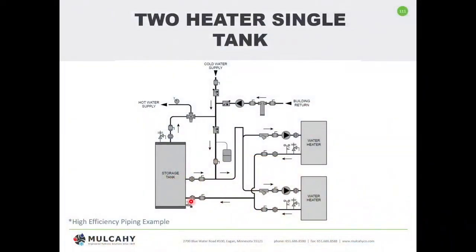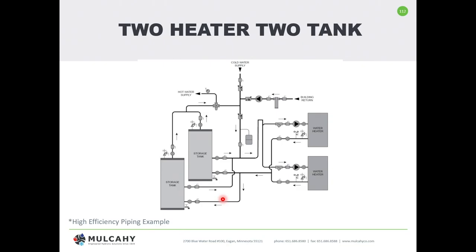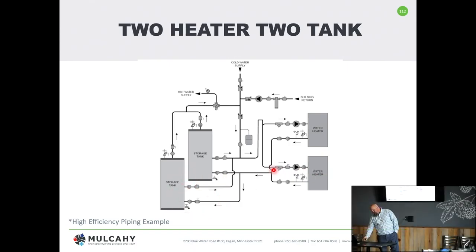With diversity we can have multiple heaters and multiple tanks — two heaters, two pumps. We interconnect the piping, the cold water still comes into the same location between the heater and the tank. In a high-efficiency setup, cold water goes into the heater first; in a standard efficiency, it would be flipped with that cold line going into the tank first. With two heaters and two tanks it's still just a single heater/single tank setup times two, so the piping stays the same — out of the heater into the tank, from the tank back into the heater.